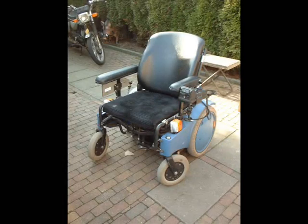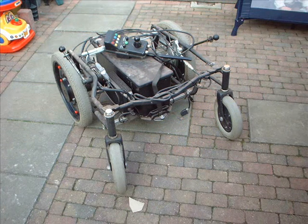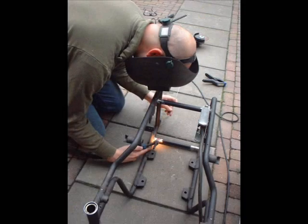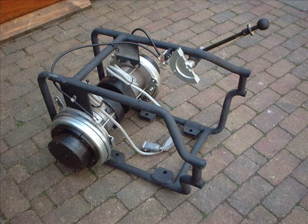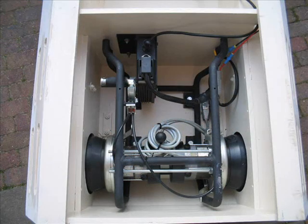In the design phase of the project, I thought that using a second-hand joystick-operated electric wheelchair would be the perfect base for a drivetrain. They are a very rugged, reliable and complete system that also allow the tank to perform neutral turns because they are able to turn the wheels in opposite directions. Here in the Netherlands, they are readily available at a reasonable price. The wheelchair was stripped down to the drivetrain frame, which was then cut and welded to fit the hull, and the motors were remounted. They are 24-volt, 800-watt motors with an electromagnetic brake. With the motors mounted on the frame, it makes it a modular unit that can be taken out of the tank for maintenance when necessary.